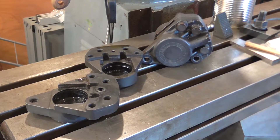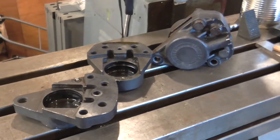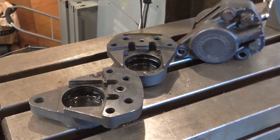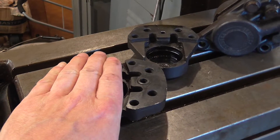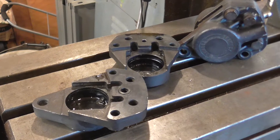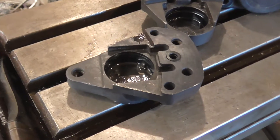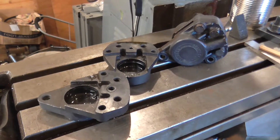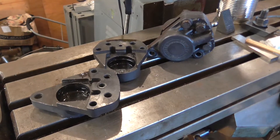I've got a couple of Marini brake calipers in for a rebuild. I've already split one and got the pistons out — I did this with an airline through the transfer port with pressure set relatively low so I could keep a hand on the piston and feel its movement. They were quite stubborn; I had to push them out a little with the air, then push them back in to get them moving. Things are pretty sludgy in there, so they'll get a wash down with solvent and then go in the ultrasonic cleaning tank.